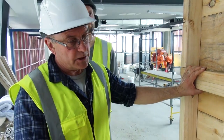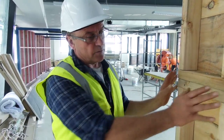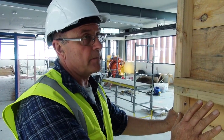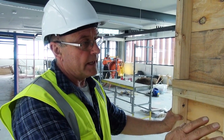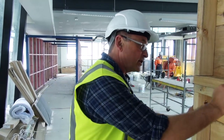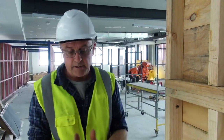Behind here we have a finished wall. On this particular job, once we finish the wall we take the formwork off and wet the wall to help the curing, but then we actually put the formwork back on again. That just helps protect the wall because there are so many people here doing so many different tasks, and the wall is quite fragile, especially in the first week. So this is really just put back on as a protective layer — it's actually not touching the earth. We put a spacer in so we keep it around about 50mm off the wall, simply to protect it.